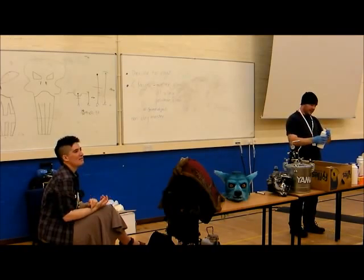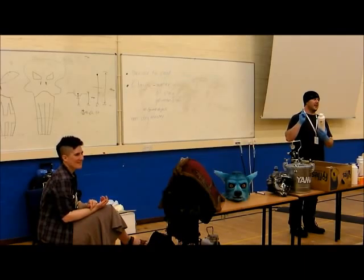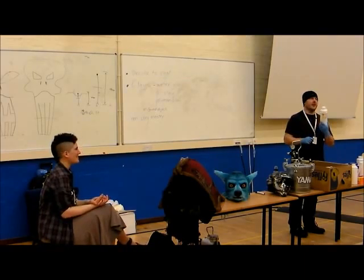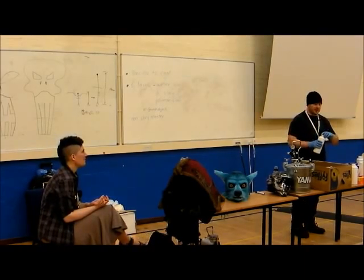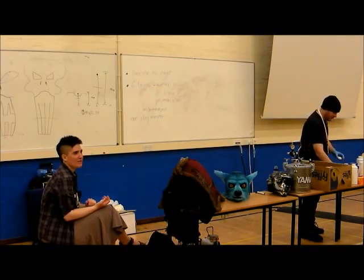The abbreviated name is MDI, so diisocyanate. You might recognise the word cyanate, it's related to cyanide. Yellow goes crusty sometimes, it jams the bottom, because that is MDI. It goes crusty because it reacts with moisture in the air.